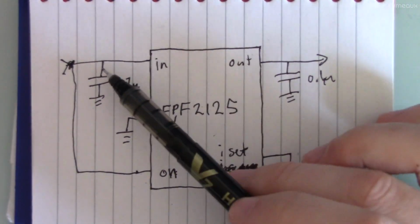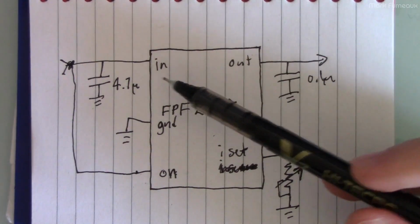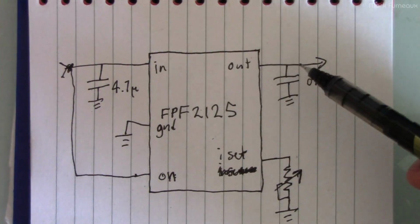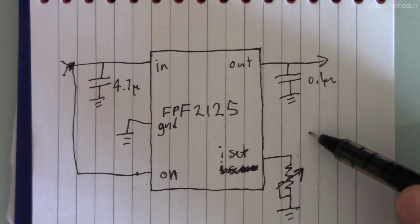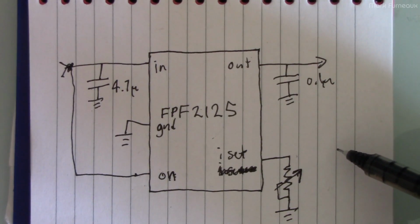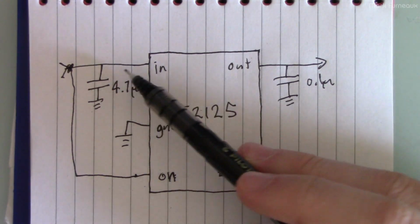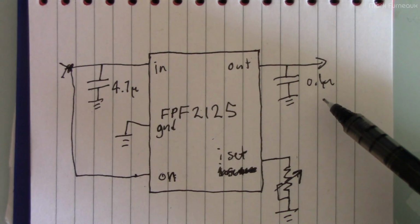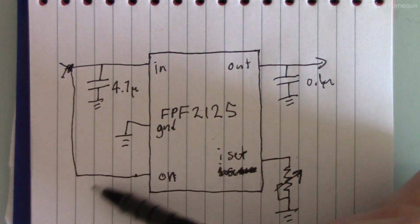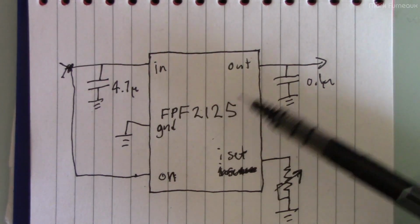It's pretty straightforward. The device obviously is going to try and pull current, and when you reach the current limit, the voltage, of course, on the output is going to drop. And so most devices, when they see a battery charger, just start to pull more and more current until they see the voltage start to go down. And once the voltage starts to go down, they sort of back off a bit, and that's the current that they charge at. So by setting this current limit, this will let that amount of current through before it goes constant current, and the voltage starts to go down, at which point the device will back off. And so it doesn't matter how much current the source can supply, the output can only supply however much current you program into this device.